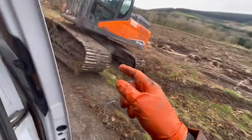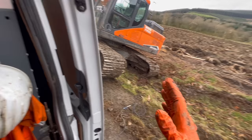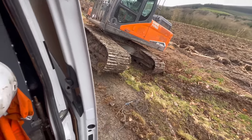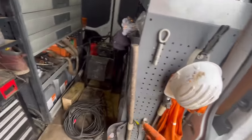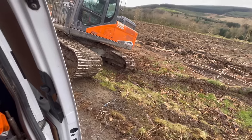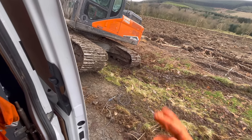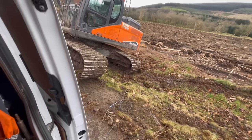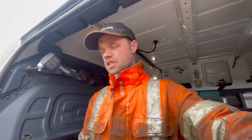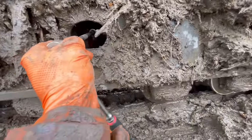I'm going to drop the tension of the track, and I'm going to chuck these blocks of wood underneath it so it's not going to fall. I mean, I guarantee you it won't drop any, but definitely should put wood underneath there just in case. And then what I'll do is I'll bat them with a hammer and a punch just to kind of shock the threads a bit, and then fingers crossed, they'll just spin out. Positive thinking. I hope so.